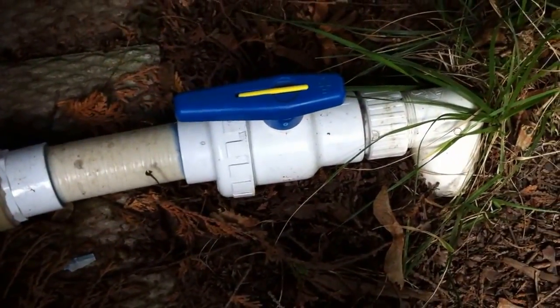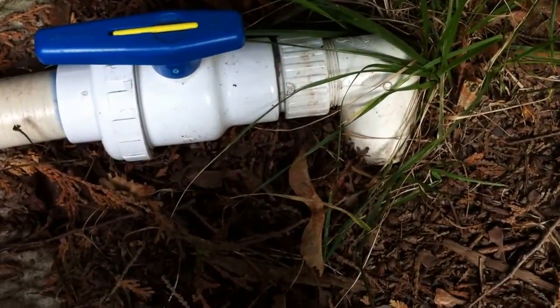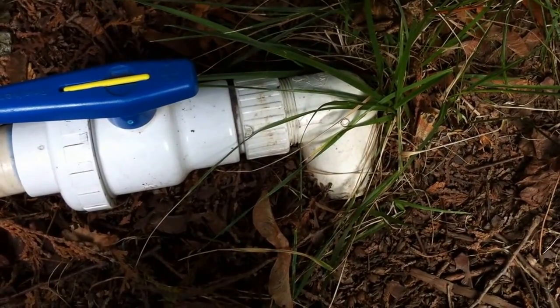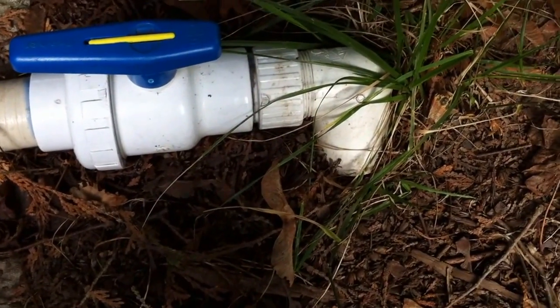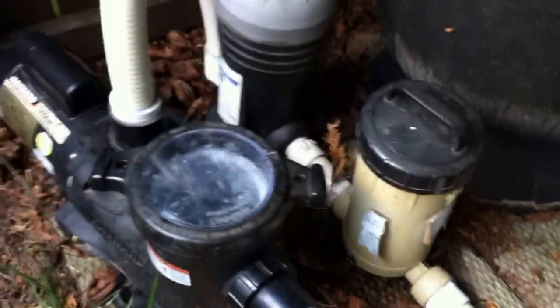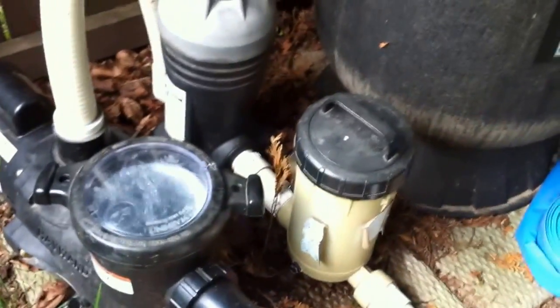Out from there we go into another single union ball valve, which I like — I like to see valves everywhere, that makes winterization super easy. Looks like the original installer, for whatever reason, plumbed in a 90 that has a slip port on one connection and a threaded port on the other. No reason to use threaded — it was probably the last thing he had in his truck, which required a couple of extra fittings to transition back into slip connections. So even though it's a simple system, there's a lot to talk about here. You can imagine how much you can find with a really complicated mechanical room. But this one's passably good, and it's a pretty entry-level system overall.